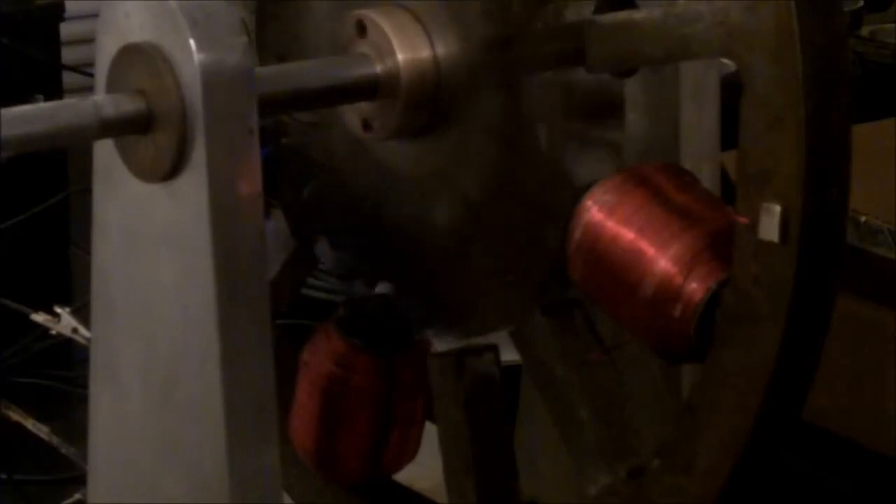I used that second coil to get it going because I can make it a steady frequency. If I spin it by hand, there's jerking and what have you. As of right now, I can get 20 Hertz. I haven't been able to do 30 Hertz. I've got a few things on the way that I think can help me get a steady speed that's close enough to sync up, but as of right now it's hit and miss.